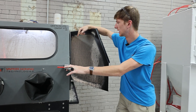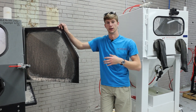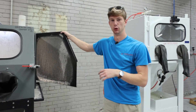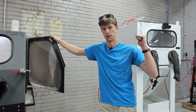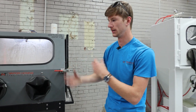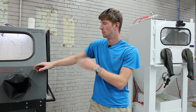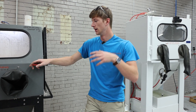This machine is an 800 Base — a great in-between option. We're going to use the mixture that's in this machine, which is glass bead and aluminum oxide. We have predetermined amounts for different applications, and we can get you all that information along with other possible mixtures. One cool thing about wet blasting is that because you're not pulling from a hopper, it's constantly mixing and recirculating, so you can mix media and tailor very specific surface roughness results. A lot of people use this specific mixture because the aluminum oxide cleans parts fast while the glass bead leaves them with a nice shine — great for productivity.